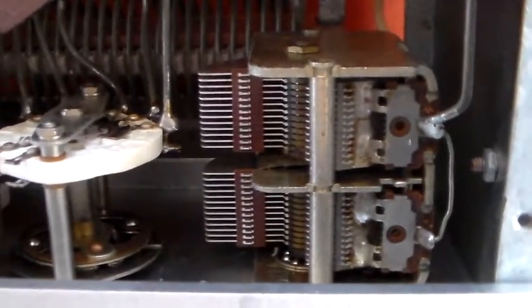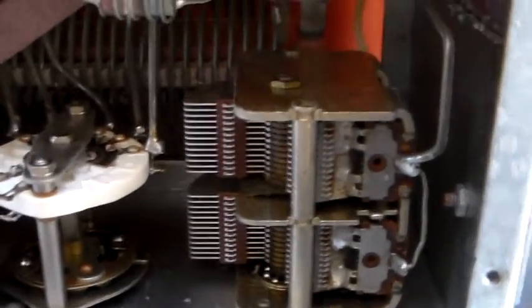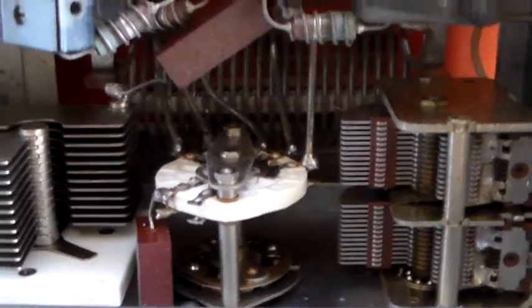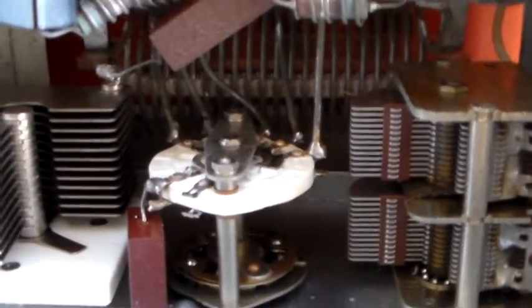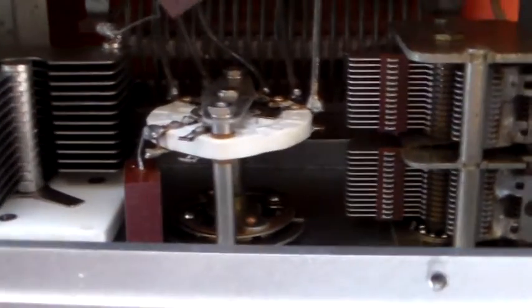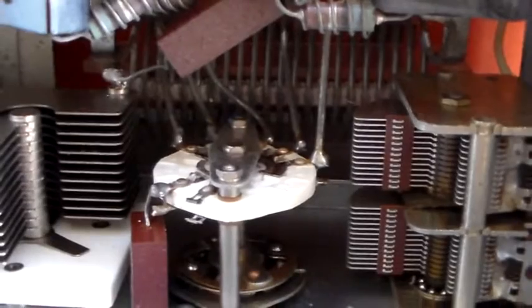Even though they're from 1967 they may be okay. If they're not, I actually saw a replacement capacitor kit for this very unit for about $45 American on eBay. Coming across to the PA compartment — the amplifier itself — on the left you can see the plate tune capacitor, in the middle the ceramic band selector switch, and on the right the load capacitor, which is quite small — the sort you'd see in old valve receivers. This has definitely been designed to be tuned into a 50-ohm dummy load and then matched to the antenna with an ATU.